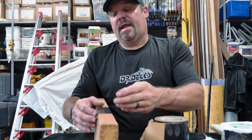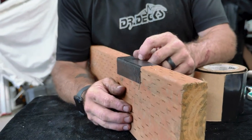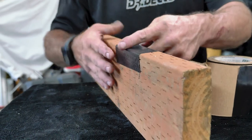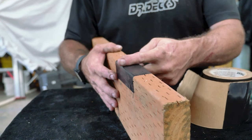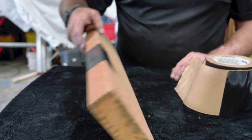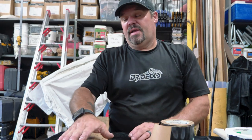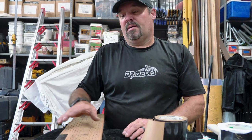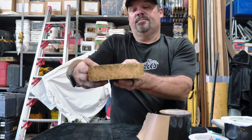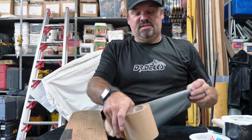When you have two deck boards sitting here, the tape gives a protective barrier between your decking and your framing — the gaps are what I'm most concerned about for joist protection. When we run flat blocking, we have to protect not only that flat block but any place water would permeate. If there's a flat block with joists on either side, I want to tape the whole top side — usually with six inch 3040.